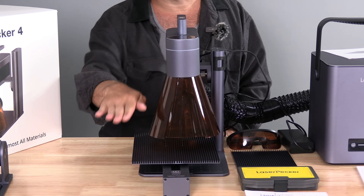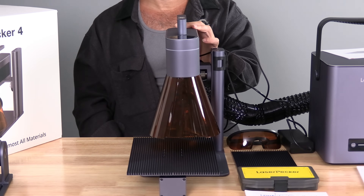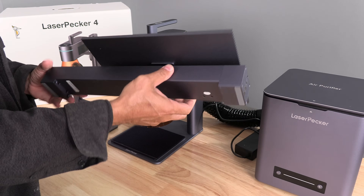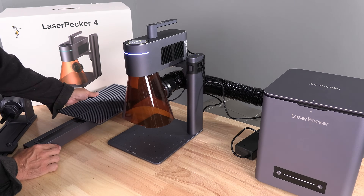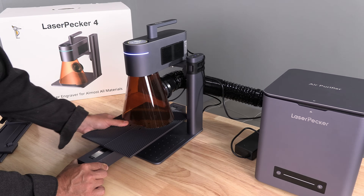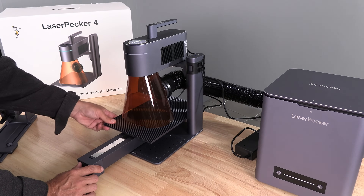This plate slides forward and backward, and this movement allows for a much larger working area. This is a powered plate and it moves by itself during a laser job. One of my immediate disappointments with the slide attachment is no easy way to line up — it simply butts up against the plate. With no actual hardware to secure it or notches for it to slip into, it's totally up to you to butt it up against the base properly so you have straight movement forward and backward. I also found that with no hardware holding the hose in place, it can droop onto the plate. I suppose a little experience will go a long way in using this slide attachment properly.